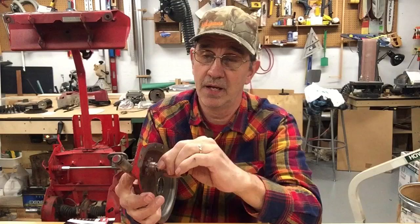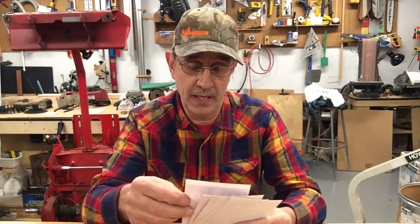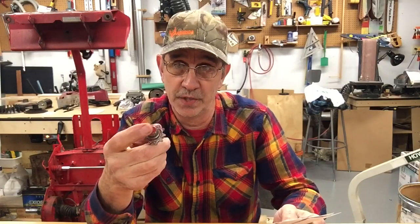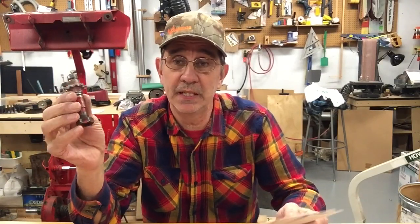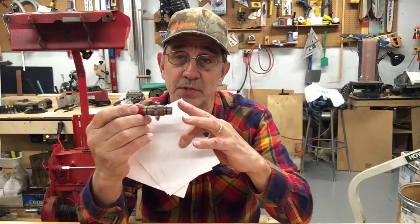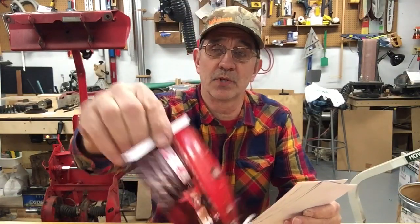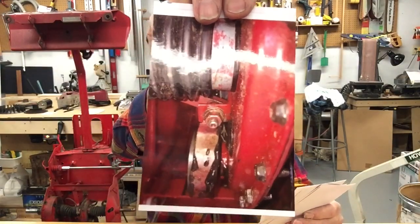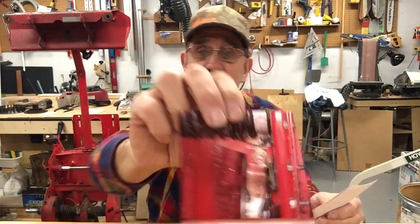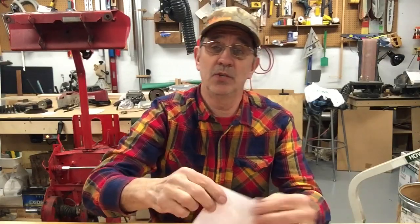This guy rebuilt his machine and on the back side there's a hole drilled and tapped. The old ones don't have the o-rings — they just think it's gonna seal on that friction fit, but it's not a press fit, it's a slip fit. Here's a picture of his brake disc with his lube leaking out. He asked: 'Jim, what can I do? The stuff is leaking out.'